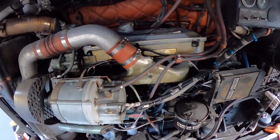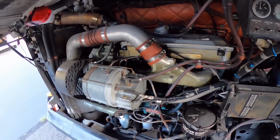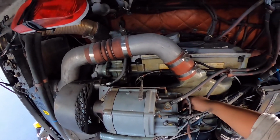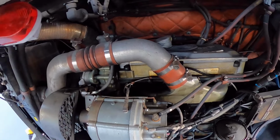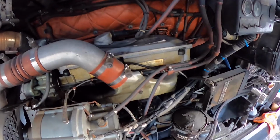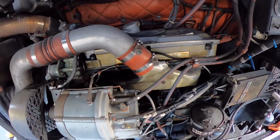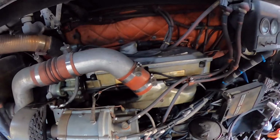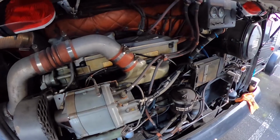And this dryer is starting to fail again. It's almost a year, but it's definitely starting to fail again. So I ended up getting another Wabco System Saver, because, if I'm not mistaken, and I know some of these are different, most of these Carter Flexibles have the Wabco System Saver 1200. I found that out by going underneath the bus, looking at it, taking pictures and cleaning up all the gunk and grime. I changed the cartridge on that. It worked for a little bit, and then I was still having the same problem. So I ended up just going with the Bendix.